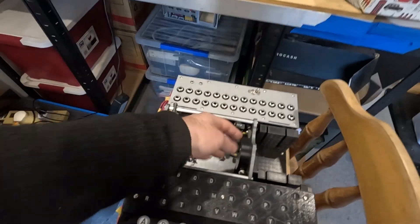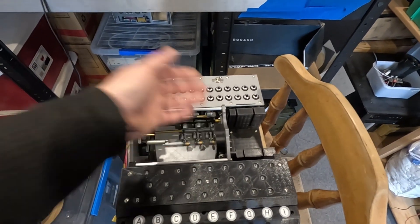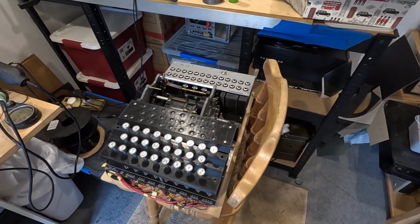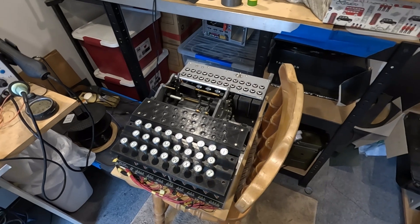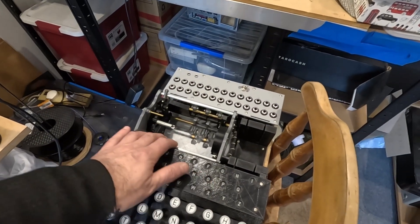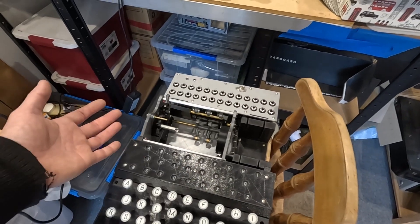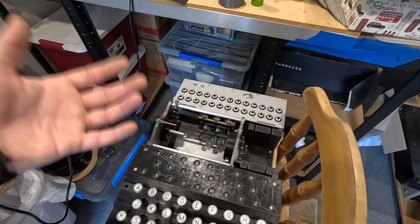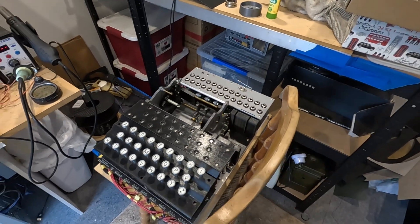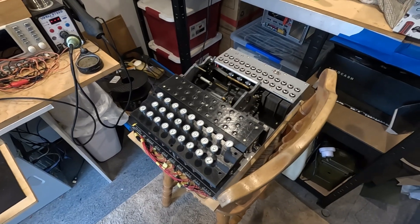I think what I'll be able to do is shorten this entry wheel and put a circuit board here that'll pick up those contacts, hidden away somewhere so that it's not obvious that's what's happening. I think that's my best bet to actually make progress with this machine now. It's just so tricky trying to get a mechanism like this to work when it's so flexible because it's built of plastic. If you try beefing up all of the components to make them heavier or thicker, then the machine doesn't look like the real machines — so it's a compromise.